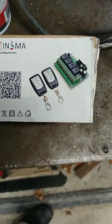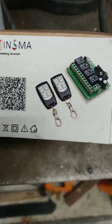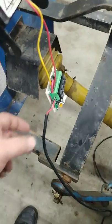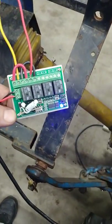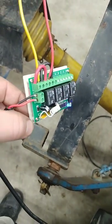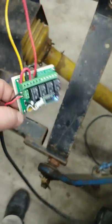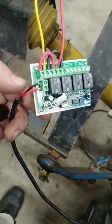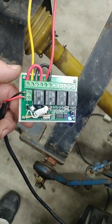Here's my review of this Insma be smart relay setup with two remotes. I got it wired up like it says on the manual, or actually the schematic that's on Amazon. I actually jumped it underneath — it shows to jump on the outside but there's no way getting 16 gauge wire on there to jump it. I've got a 12 volt power supply here, good for about 60 amps, so it's way overkill. There's my input power and jumpers on the outside.